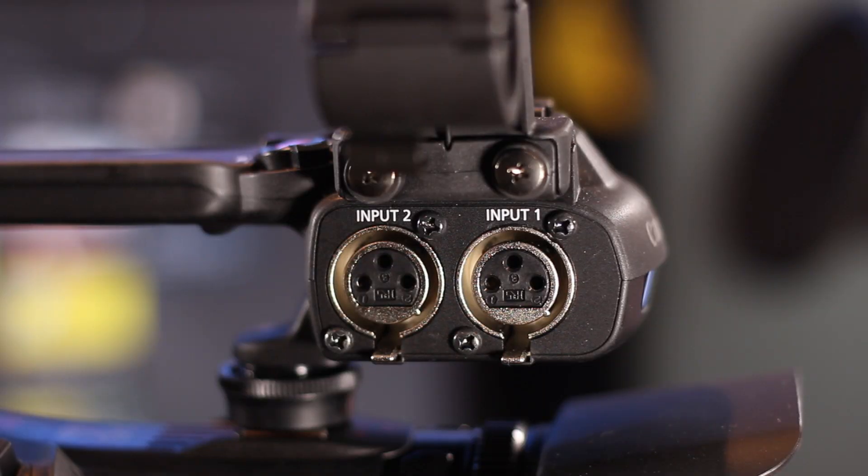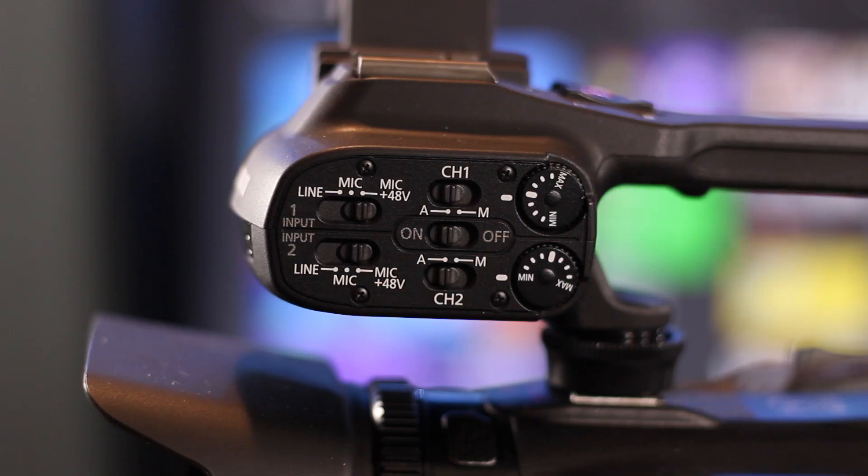The handle gives you two XLR inputs, and on the opposite side are all your controls — you can set the exact levels of each audio input manually or switch to automatic. You also have the option to turn phantom power on and off, which is great for shotgun mics that need it. Unlike DSLRs which need a completely separate audio interface to run a microphone, this has it all built in. Overall this camcorder is excellent in the audio department — way better than a DSLR — and even the internal microphone is there if you need it as a stereo capsule option.